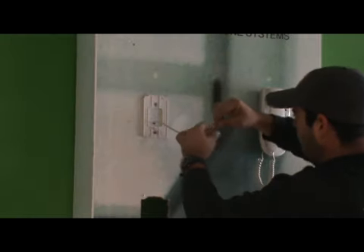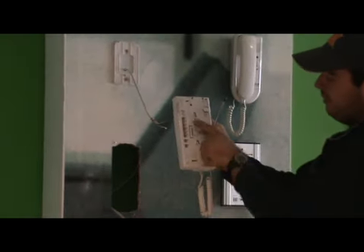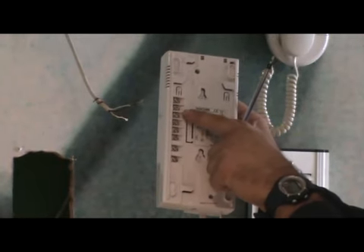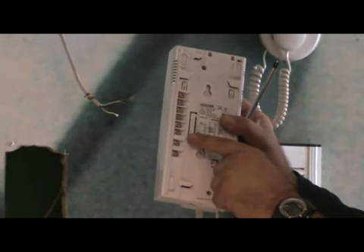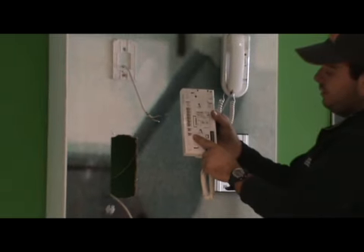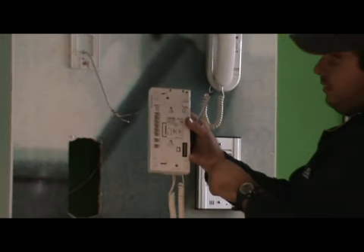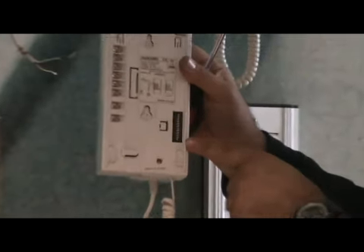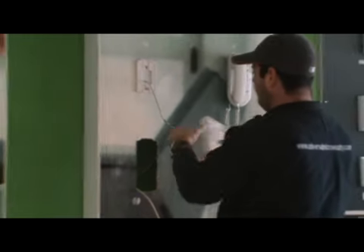You will use six wires from the panel to the handset, and the other two wires go from one handset to another. The terminals are numbered one through eight. The first five are for communication to the panel. You can see the DIP switch used to configure the handset number — this one is set to number one. Refer to the diagram in the booklet.